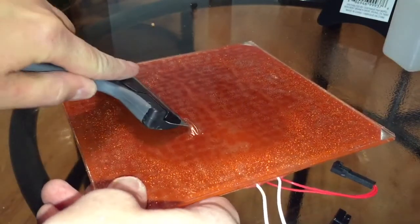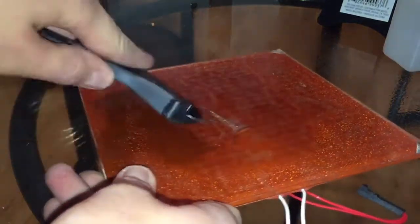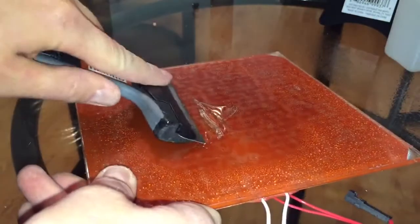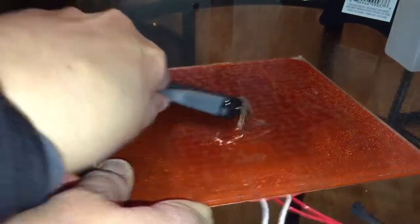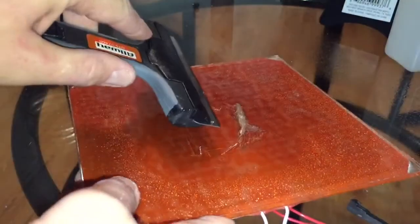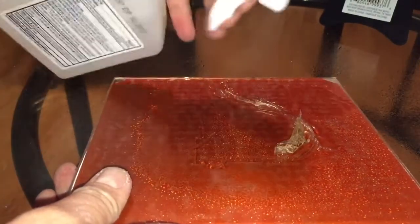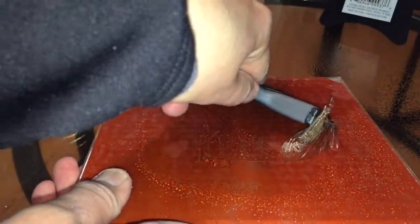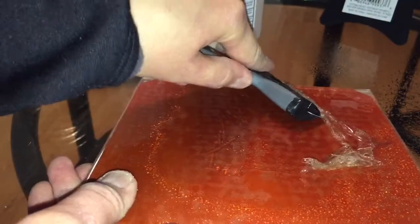Getting it started is a little tricky. Remove chunks of the adhesive as they come off, use a paper towel to clean them off carefully, and continue all the way to the edge using your big scraper. As you go, keep applying IPA to loosen things up — most of it should come off in one big chunk, which is the way you want to do it.